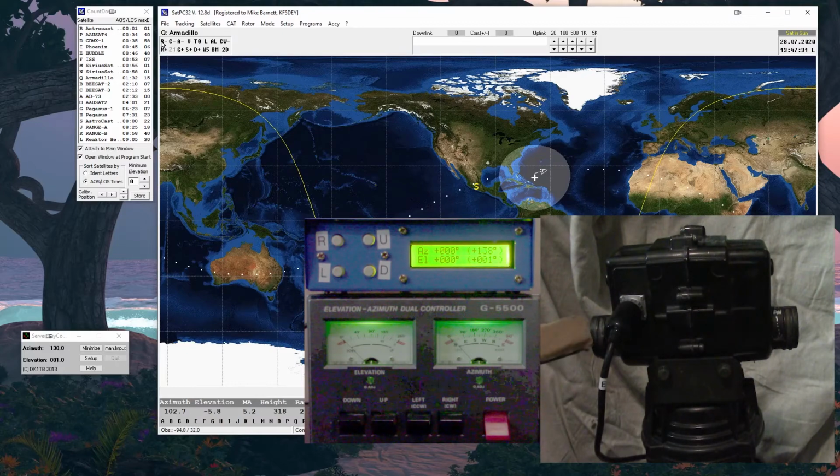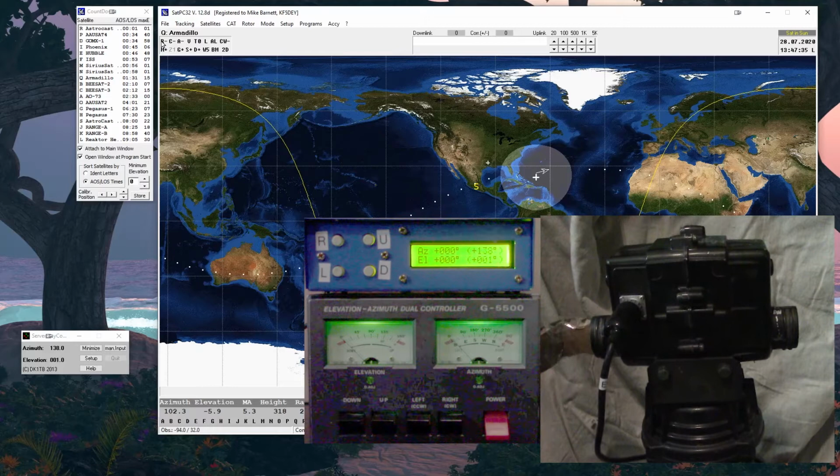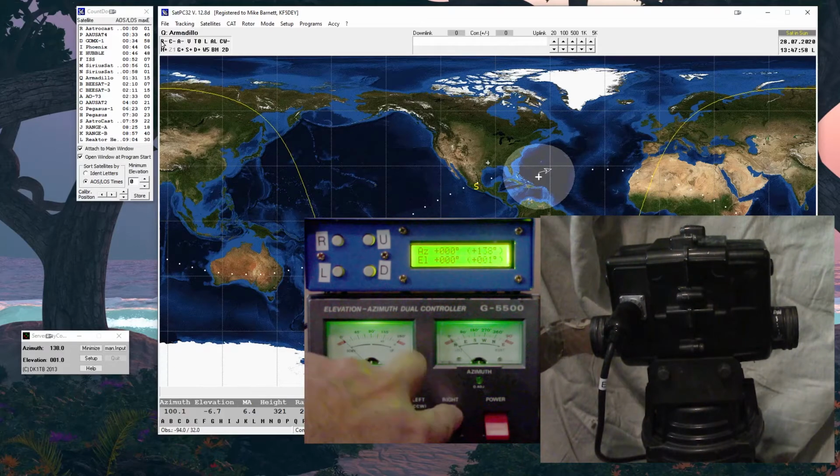And I also made some marks on there to keep track of what's what. And like I said, the cardboard's in there just for your benefit. But on the actual setup, you want to somehow indicate the top and the forward position when you're doing your checks, so that when you mount the antennas, you mount them correctly in the correct position. Easy mistake to make.